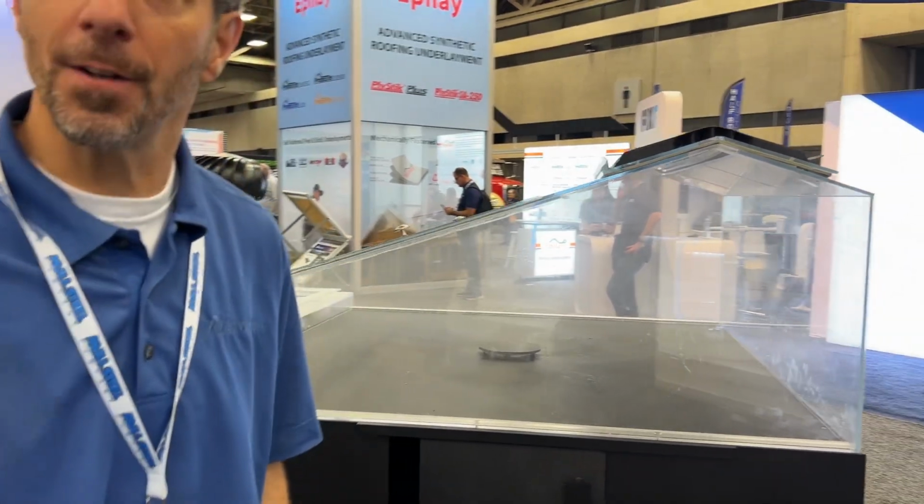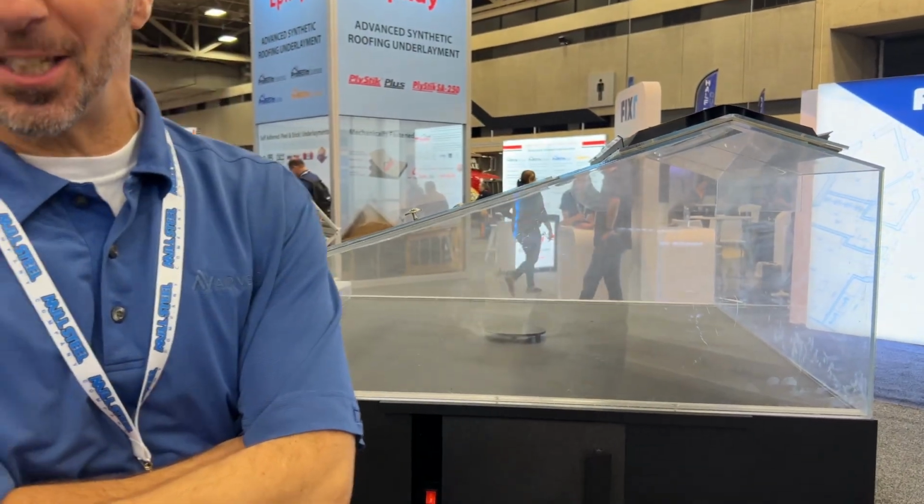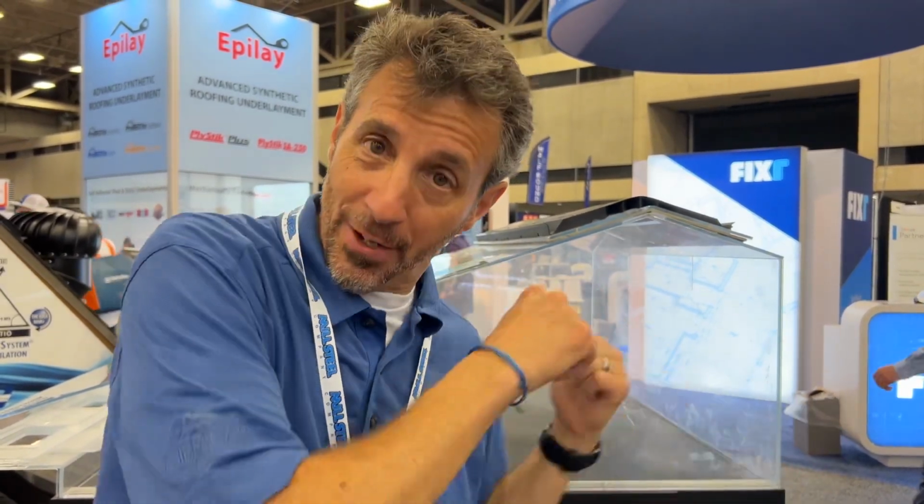Another question, Paul. Is it okay to mix different kinds of vents on the roof? Let's say we're going to install ridge vents, but that might not be enough, so we're going to give you some of the round vents or maybe a solar power vent. Is that okay? It is not okay. Thank you for asking. It's the second most common mistake in residential attic ventilation. For the record, the first mistake is lack of intake, which you've already covered. There are 5 types of exhaust: ridge vents, wind turbines, box vents, power fans, gable vents. We don't want any 2 of those 5 on the same roof. They work against each other. It confuses the airflow. It short circuits the system. Pick one type, run with it, and then give it intake.